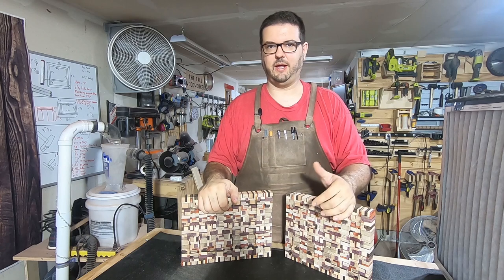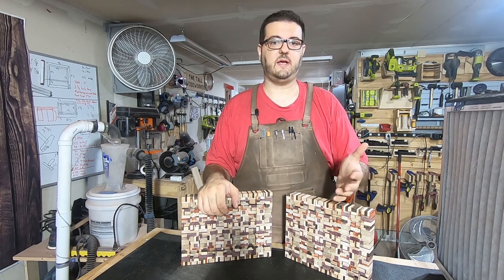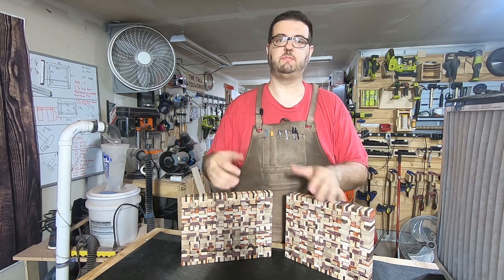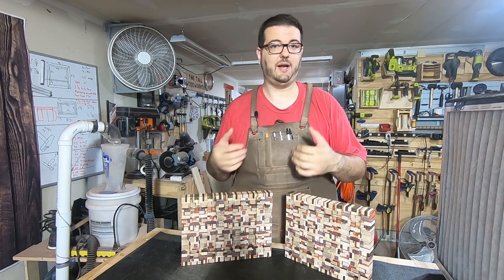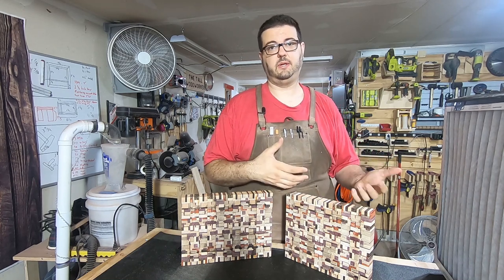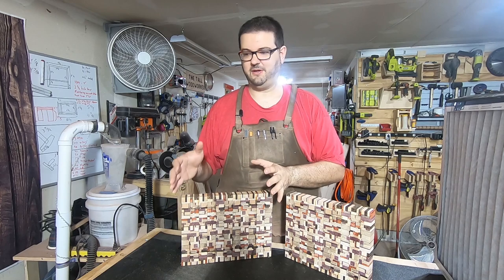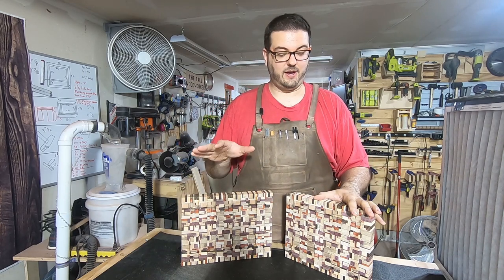Since it's end grain, I am not putting this thing through my planer. I've heard people say it's perfectly fine to throw it through, and I've also seen pictures of end grain cutting boards that have exploded after being sent through the planer. I'm not going to get into the debate of should you or should you not — I'm making the decision that I'm not going to, especially since I'm still using a straight blade cutter in my planer. It's not from a safety perspective; I just don't want to see three and a half days of work completely fly apart. So I'm going to be using sanders instead.